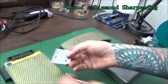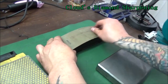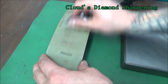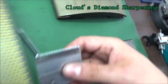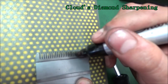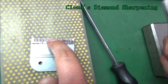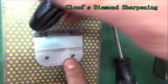So I took this blade apart — it's my marked-up blade. We'll try to run it back and forth. Now we look at it and get a marker so you can see: there's shiny here, and shiny here. What it's doing is it doesn't go to the tip of the teeth, so it's going to pull in the middle of the blade. It will cut a little bit on the sides.